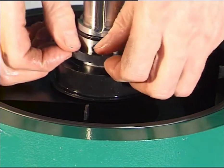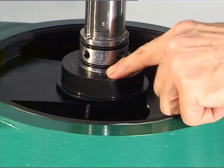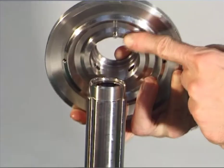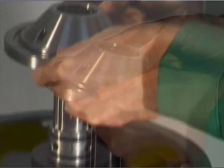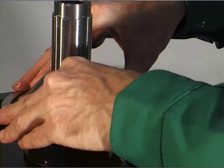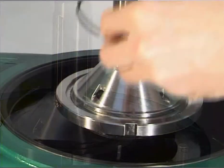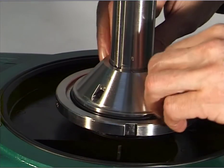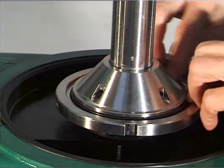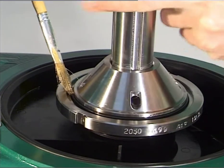After cleaning, immediately remove the gasket. Place the bottom on the spindle. Pay attention to correct positioning — the zero marks on the bottom and spindle must be aligned. Insert the gasket in the groove of the bottom. Grease the gasket as specified in the lubrication schedule.